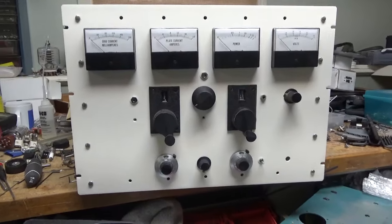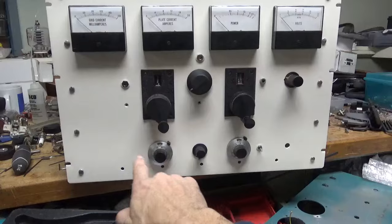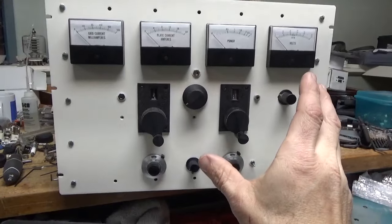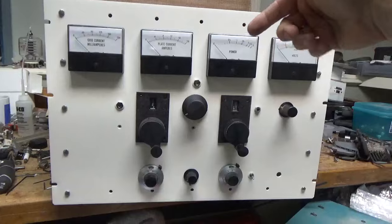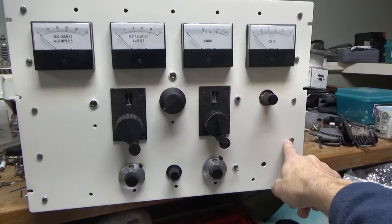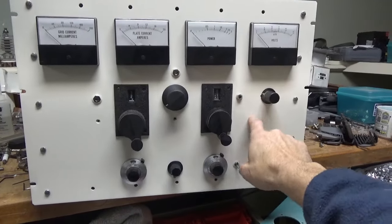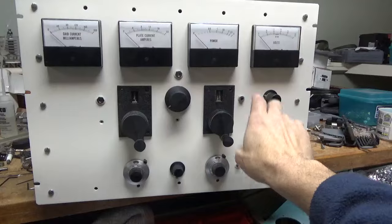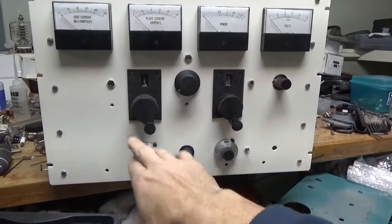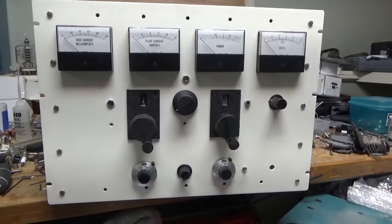This was a lot of work. There's a bottom cover that has a lip on it that folds over — that's what these holes are for. It's a very RF-tight enclosure, very well built — eighth-inch-thick material. Same for the top: the top cover has a lip, and these holes are for that. I used plastic washers behind the screws so it doesn't gouge the paint. I had to let this set for a few days — it's epoxy type paint — and I used the proper size washers behind all the feed-through bushings.